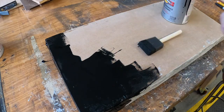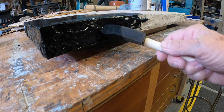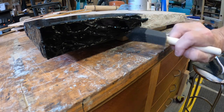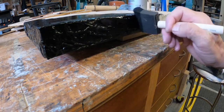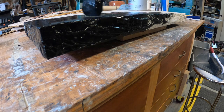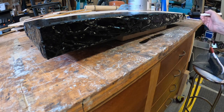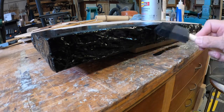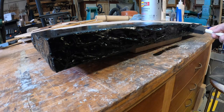I use oil-based paint because it seals better. For what I'm doing — adding resin — I believe it's a better quality paint. I've used latex in the past, but oil base helps with sealing the MDF. You want to make sure it's sealed really well, and this is a gloss so it does a nicer job than a latex paint.